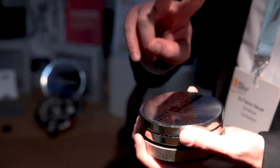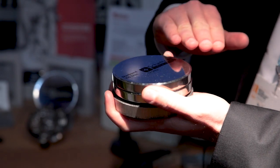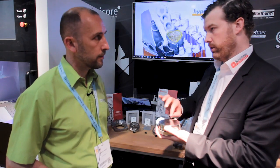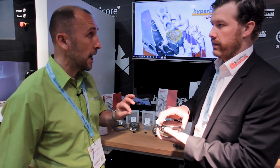So there are two disadvantages. First, when you have this rod and you cut it, you need a saw to cut it. And everywhere you use a saw, there's heat, and the heat will affect the surface a little bit. So the surface will be a little bit harder than the inside of the disc. Okay, so which also makes some problems with the bur. You better know it than I do. When you're coming to milling, then you have issues. It's the first hard layer, and then you go inside.